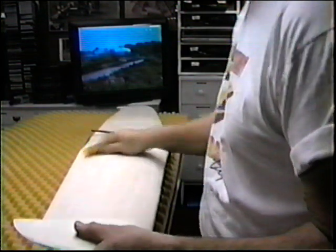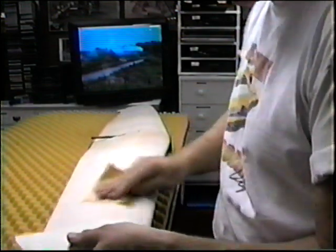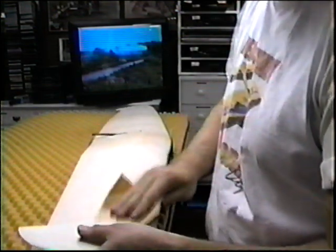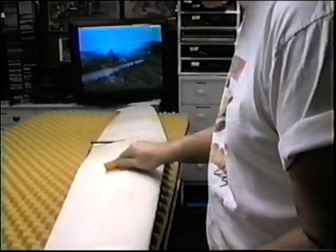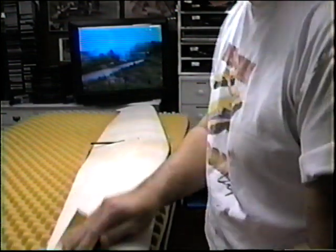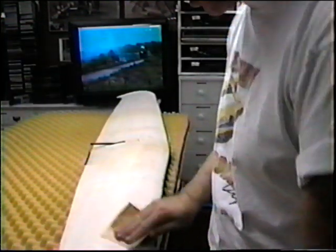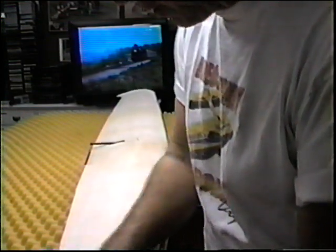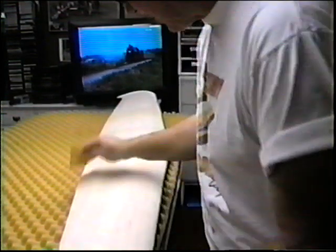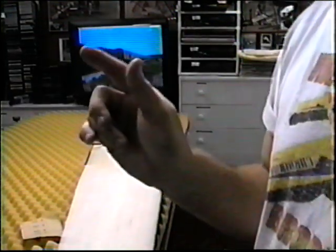This is not like a real sanding. This is just a, what shall we call it? We're just taking out the wrinkles. This is an important step, and I didn't want to leave this out. Because what I'm going to do then tonight, after I'm all done sanding this, and this will take maybe a couple hours or so, is try to get another couple of coats of dope on it. And get ready, see how that powder's off? Get ready to start building up that shine.